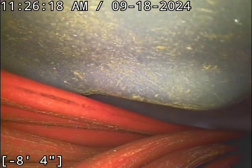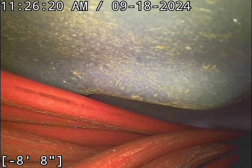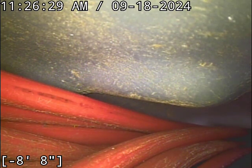If you put a lot of grease down your line, it will indeed build up, and grease is responsible for a lot of blockages, especially when you get a really thick layer throughout the entire line. Just turns your pipe into a sticky mess, and it is often the culprit behind a lot of stuff that would otherwise make its way out. Especially when you have kiddos in the household that are wadding up their toilet paper like a softball. Those blockages a lot of times will block, but temporarily, because they're made of a proper item like toilet paper that disintegrates on its own. And under the head pressure of water building up behind them, a lot of times they break loose and you have no idea a blockage even occurred.